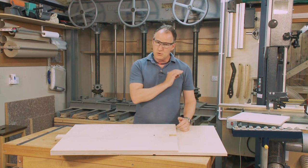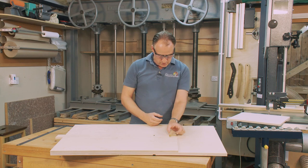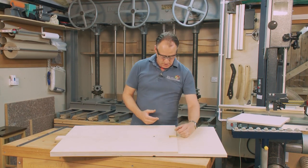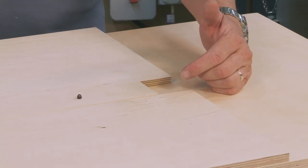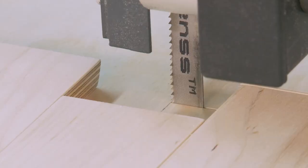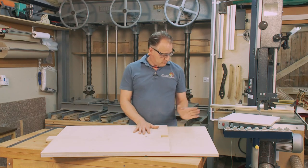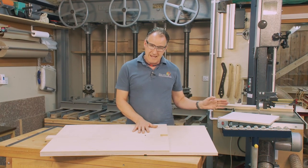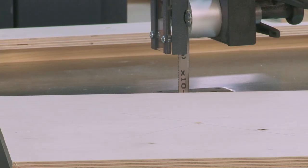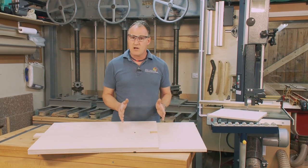The bandsaw blade I put in will vary depending on whether I'm doing a small radius or a very large one. For a small 2 inch radius I want a narrow blade; for a 5 foot radius I will have a wide blade, so the width of this blade will also alter the position of our jig. What we're going to be cutting here is plywood, so I've got an M42 steel blade in the bandsaw. If I had a standard carbon blade it would cut the plywood but it wouldn't last very long - so the right blade for the material that's being cut.